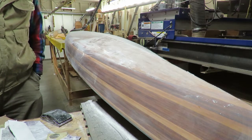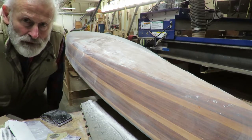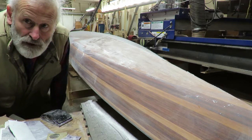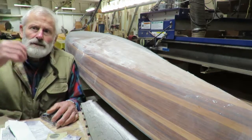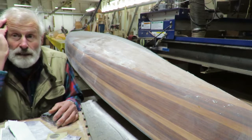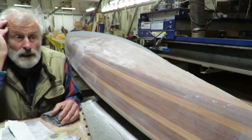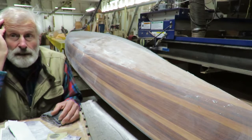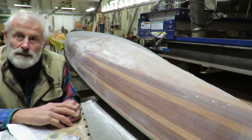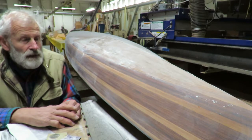And then we'll use high quality varnish with ultraviolet sunblock filters in it. I'll probably tend to use Captain's varnish, since we use that on a lot of products and have a lot of it. And that's a Z-Spar Captain's varnish. And then another Z-Spar product is Flagship varnish. It's a little bit pricier, not much different. And they promote that as having even more UV filters in it. So either Captain's varnish or Flagship will do really well. It is nice to have UV filters, and that's what you get with more expensive varnishes, because epoxy is not very UV stable, so it's nice to have a UV protective coating on top of the epoxy.